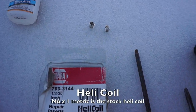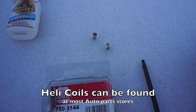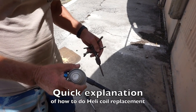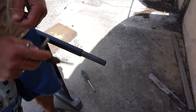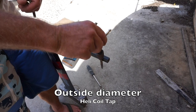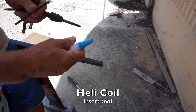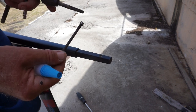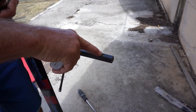Inside your fuselage is a thing called a helicoil — this is threads. This is usually used to make threads in auto parts, airplane parts, and all kinds of different applications throughout the world. We're going to go over how to do your helicoil. We've already reinserted this one, but what we did was we pulled our old helicoil out with a pair of needle nose pliers — it looks like a spring that we pull out like an accordion. We ran our outside diameter tap through the carbon, then we put a little bit of super glue on the inside of our hole, and threaded in a new helicoil straight into the hole we just tapped. Our tap will match the outside of these threads. We put it two full turns below the surface.